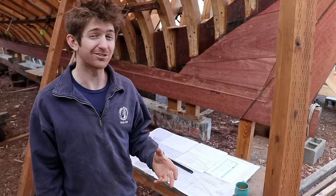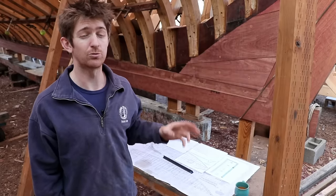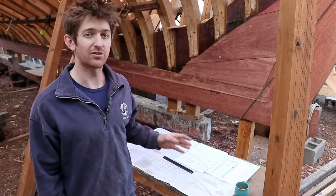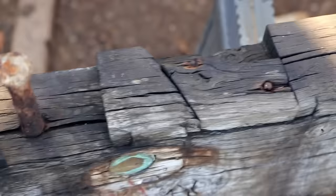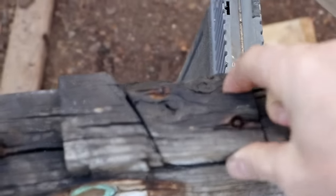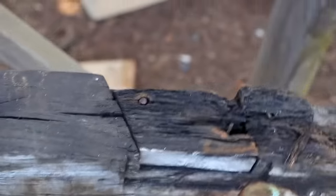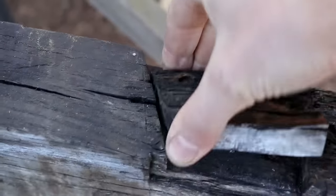And it's actually really interesting. If you look at the old beam shelf, you can see that the original builders did first of all try and follow the drawings. There are notches in the beam shelf where Albert Strange had drawn those forward deck beams. So my guess is that they actually installed those beams, and then for whatever reason, they decided to move that hatch further aft. They removed the beams, installed them further aft, and they filled in the notch that they'd cut in the beam shelf, so that it didn't look like an unattractive empty notch.